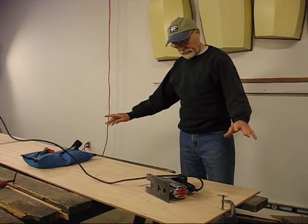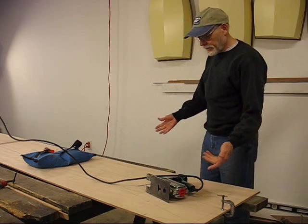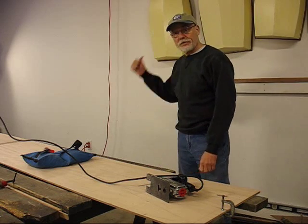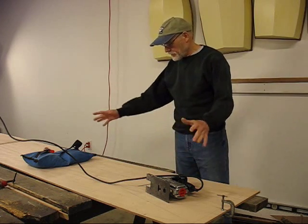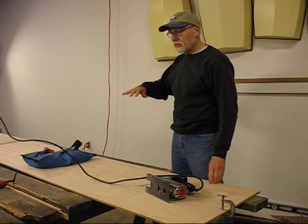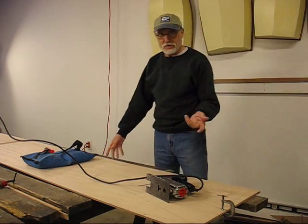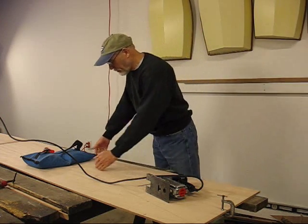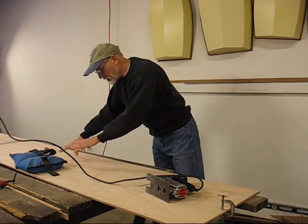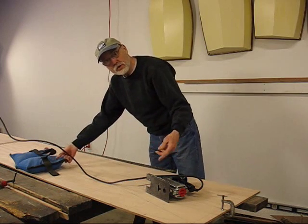The lofting's all done, all the pins and brad nails have been inserted, and the arcs have been lofted up with the battens — everything's bradded to cut out. I've removed most of the weights, keeping them around it. Sometimes it's nice to have either a weight or a clamp to keep the upper panel from bouncing up and down on the upstroke of the saw.